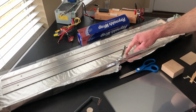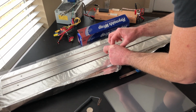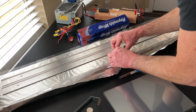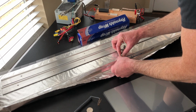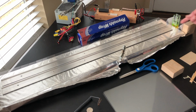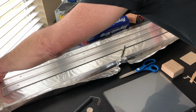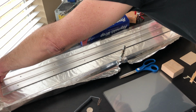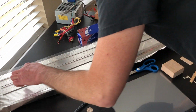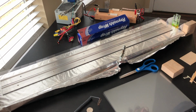We want the distance across this dielectric to be great enough to where sparks are not just going to track along the surface, because a spark will travel much further across the surface of an insulator than it will through the air. So let's see, I'm going to narrow this in a little bit, and this is a little wider down here. That looks like it may be a little over a millimeter, and this over here looks like it may be closer to 2 or 3 millimeters.